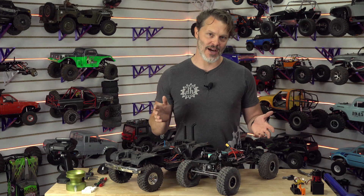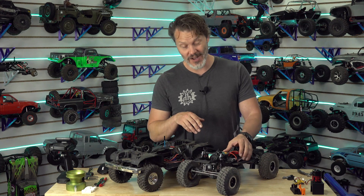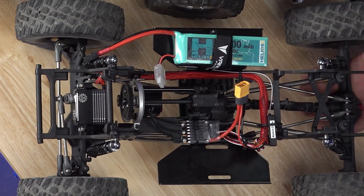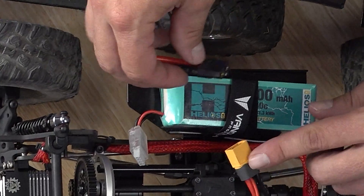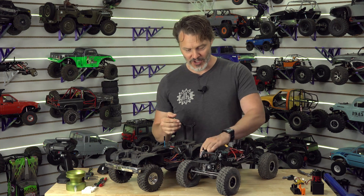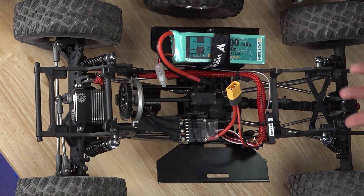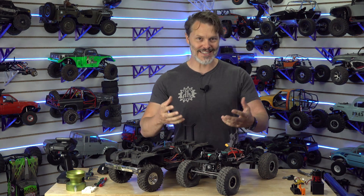Along with that, the length does actually matter because if you're carrying 10 amps of current for this much wire, it's going to make twice as less heat as this much wire. The longer the run, the more heat you have, the more voltage drop you have as well. These are just things that we can observe and try to live by. As you can see on this battery, we've got some real thick power wires coming off — this is 12 gauge and it's going to be overkill. This will end up being a slight heat sink for your motor. The bigger your motor wires are, the longer your motor wires are, the more they're going to suck heat into them. You can actually use that for heat sinking, which is what we do on a lot of competition rigs with brush motors — you essentially use that for some heat shedding, heat sinking, and the ability to soak the heat in. It's still called a heat sink, because it sinks from a source.